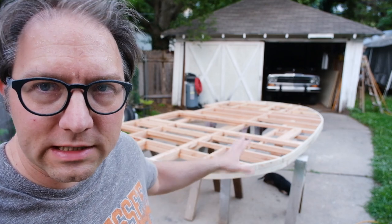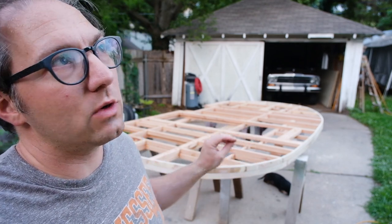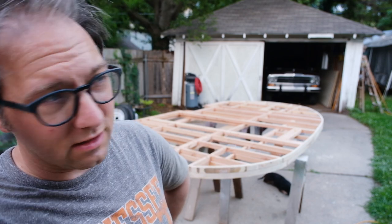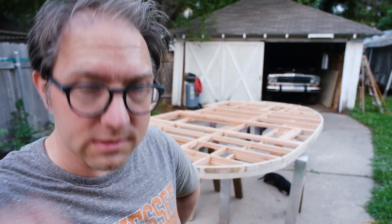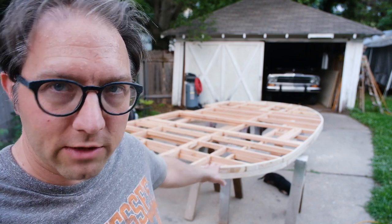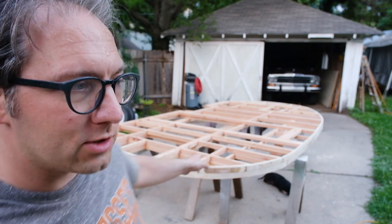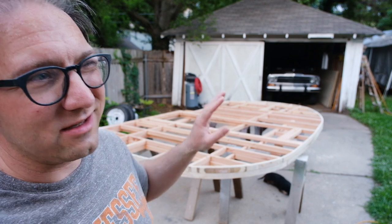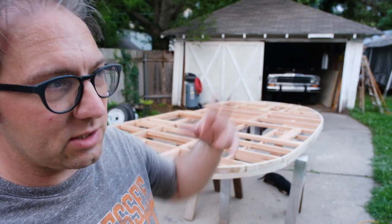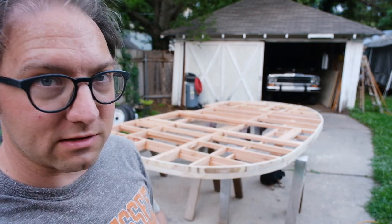So there is at least another way I can think of to match the walls, but it does require you to do the last layer of that radius a little differently, or maybe the last layers. So if you used a really long flush trim bit in a router, you could much quicker and probably ultimately more accurately match those two walls, but you're not going to want any staples in that last layer, because that will just chip up your bit and chew it all to pieces. So I wouldn't recommend doing that, because those bits are kind of expensive.